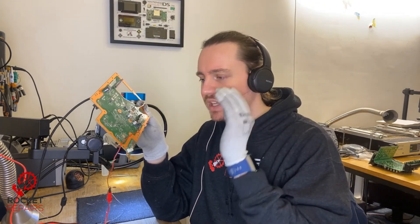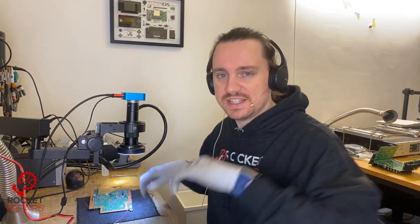Today we have quite an interesting one. It's job number 11704 — a faulty Xbox Series X that doesn't have any power. I have the board here. This is actually the top board of the Series X. There are two boards sandwiched together and we've worked out that the bottom board is absolutely fine, which is where you have the HDMI port. The top board isn't — it has a short on the 12 volt line.